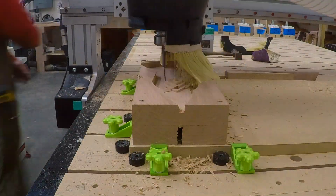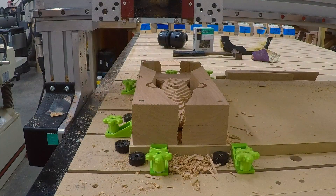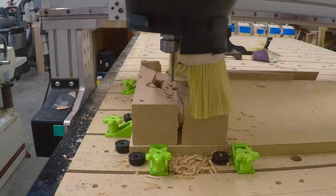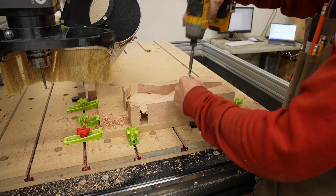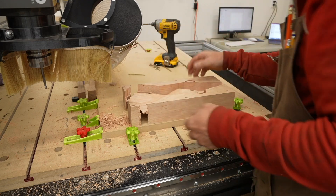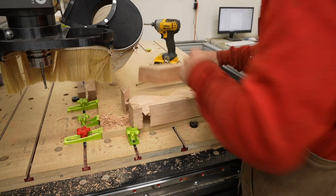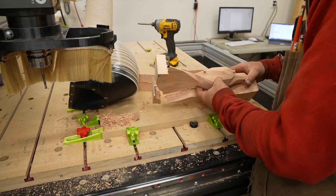The roughing pass was basically done, so at this point I just decided to export my finishing pass with a quarter-inch ball nose and run that — I didn't think it would have a collision because it wasn't going to go as deep. Now, this is one of the points where I really like Fusion 360: you can do simulations with the actual bit length and have it tell you if it's going to have a collision. Vectric V-Carve, which I used for this toolpath, doesn't do that. V-Carve is easier to set up, but you can have problems like this. So at this point I decided to switch over and use Fusion 360 for all my toolpaths.